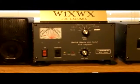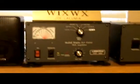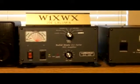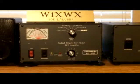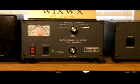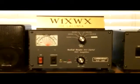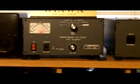It's a no-tune amp. Really, all you have to do is make sure you have this knob turned to the correct band. And if you don't, it will automatically shut itself off. So it's kind of a fail-safe amp, and that's why I wanted it. I wanted a no-tune amp because I can first tune the antenna to resonance, or at least 50 ohms back into the Flex, using this tuner that I showed you down here. I can tune that long wire antenna, and then all I have to do is make sure this is turned to the correct band, and turn it from standby to operate, and I'm ready to go, just that quick.